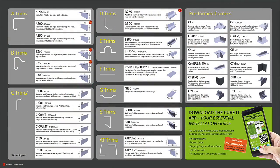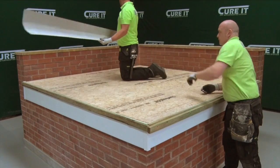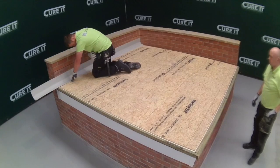A complete range of trims are available depending on the layout of the roof. Trims should always be used to adapt the system for any changes in pitch and around the entire perimeter of the roof including abutments. For this roof we will be using A200 trims, B260 raised edge trims, D260 fillet trim, C100 simulated lead flashing and C7 corners. The D260 trim is installed wherever the deck meets an abutting wall, and the C100 flashing will be fixed over the top at the end of the installation process.